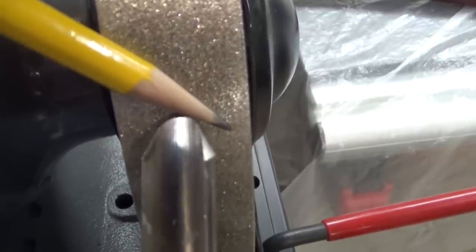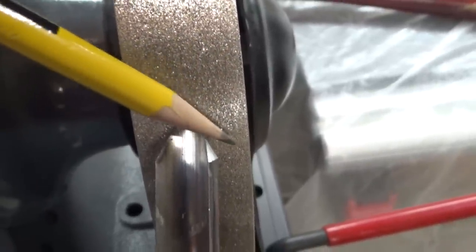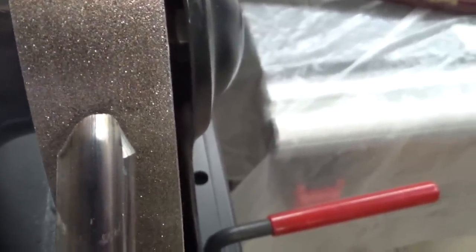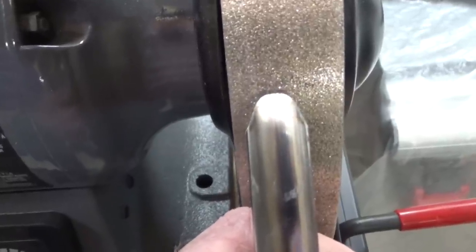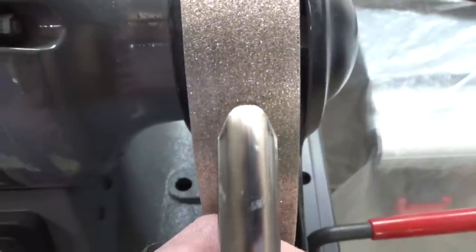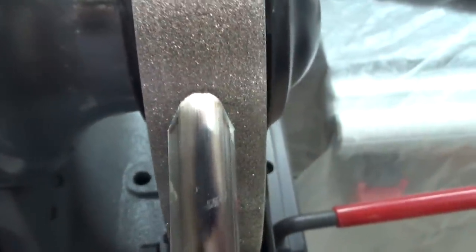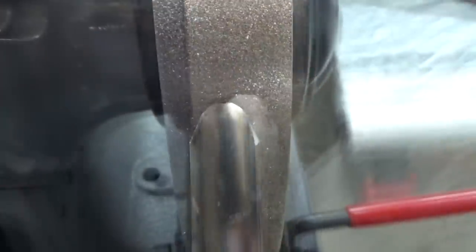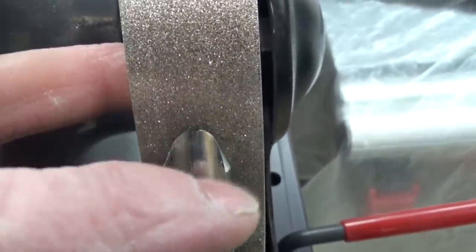At this point I want to talk about the shape of the tip of the tool. You'll notice the curve — I have this spindle gouge ground to what's called a fingernail grind, shaped like the end of a fingernail. No jig is going to replicate that shape. It's determined by how much time the tip of the tool spends on the grinding wheel versus the sides. Too much time flattens the fingernail shape; not enough time generates a pointed tip.